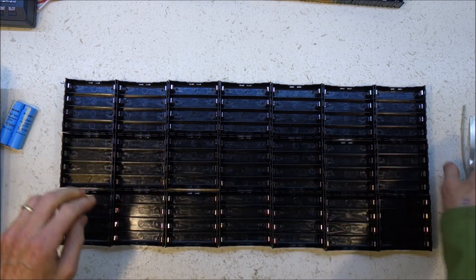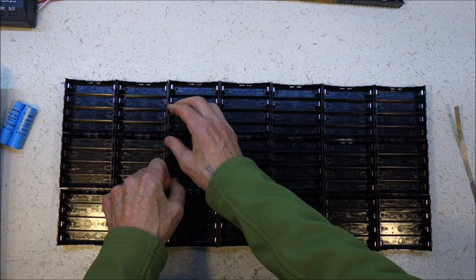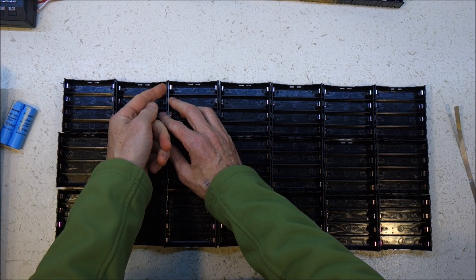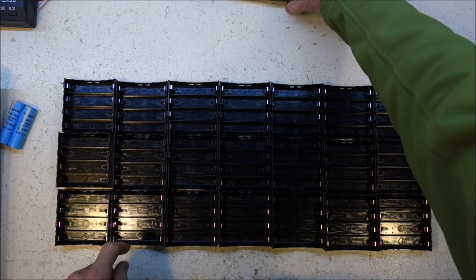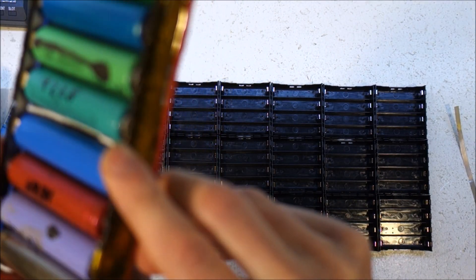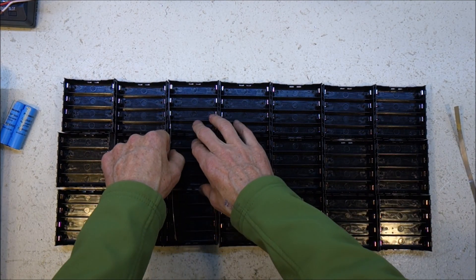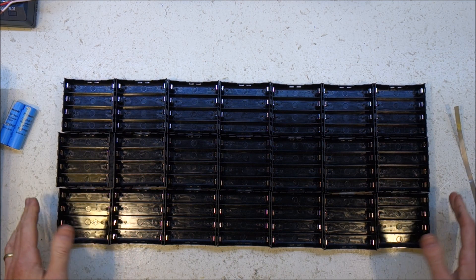The way this will work is I'll have my little strips slotted in on the negative side, and then I will solder a fuse directly from the top of the clip over to the nickel strip, just the way I've done it here — there's a tiny little fuse running from that clip around to this nickel strip. I think that will work quite nicely, and it's pretty compact. It'll make a nice little shelf.